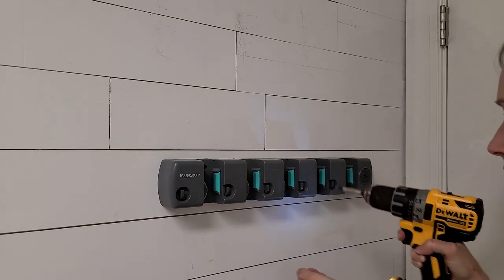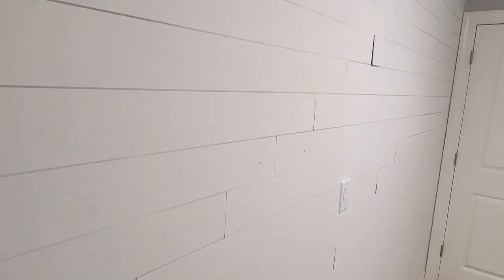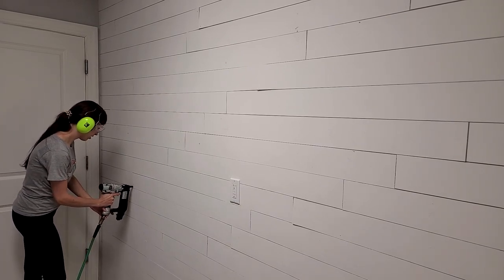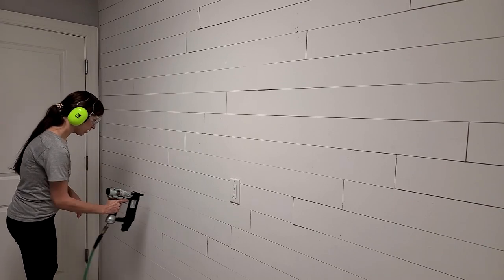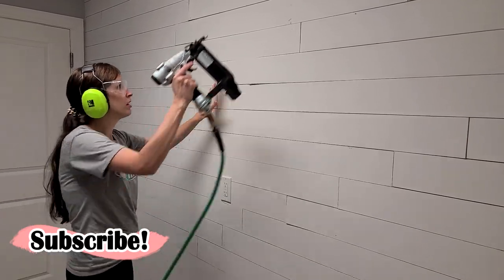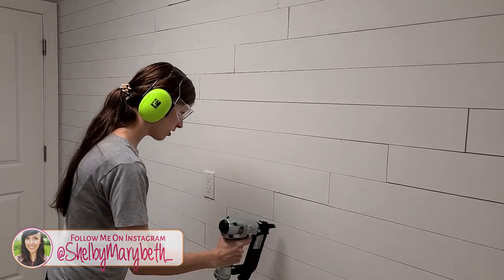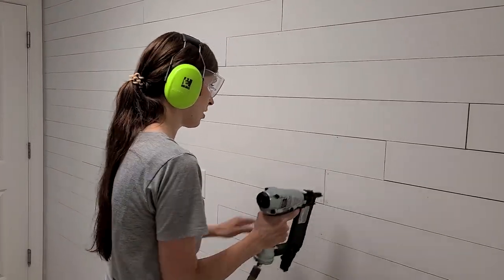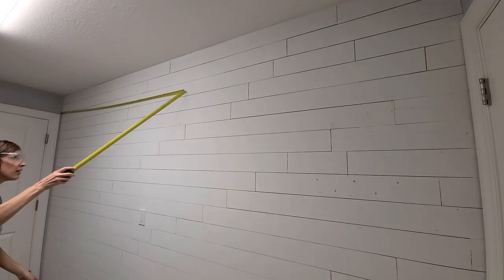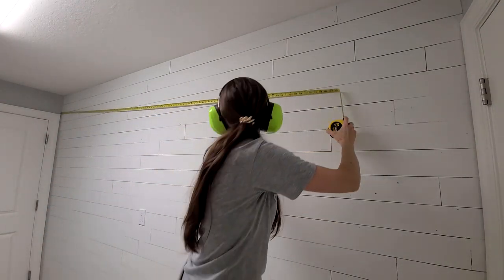I got this holder from Home Goods, but if I can find one on Amazon I will make sure to link it in the description. I got out our nail gun just to re-secure all these boards on the wall — any of the ones that are starting to pop out I'm just securing with a couple more nails. The first time we put them in they seemed very secure but it's been four years. We didn't use glue because just in case I wanted to take these out, I wanted it to be semi-easy. It's just small little nails, so if I wanted to I could completely take out all these boards and just be left with tiny little pinholes.